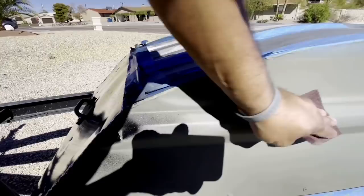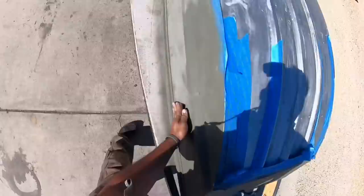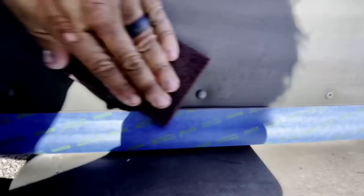One thing that Chris told me during this process is that self-etching primer, though it's probably the best thing you can do DIY for a primer like this, it seals once it dries. And you gotta re-scuff it up with a Scotch-Brite pad, not sanding paper. A Scotch-Brite pad specifically would do a much better job of just scuffing up the surface without actually removing too much of the primer. And this is a common practice done in a lot of boat fabrications for anything going on a hull like this.